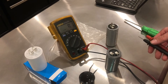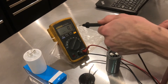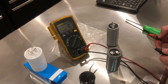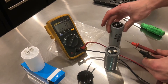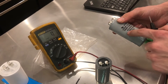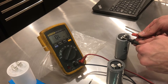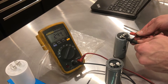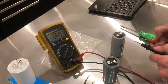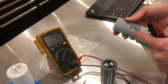For the second test, put your meter into the capacitor test mode. If you don't have that, stick around and I'll show you a third way to verify the capacitors. Let's check both start capacitors first, starting with the one that's supposedly bad. The rating is 200 microfarads. It usually takes a couple seconds for the meter to register the reading, especially on larger capacitors. It's reading 240, which is significantly higher than the rating and definitely out of spec.